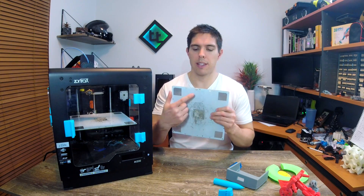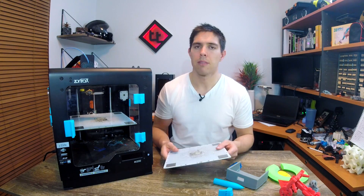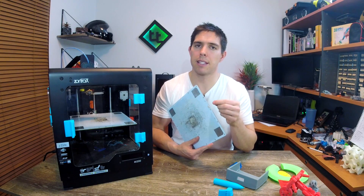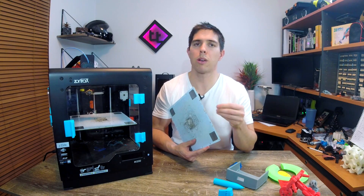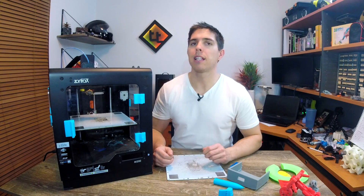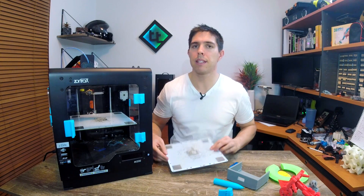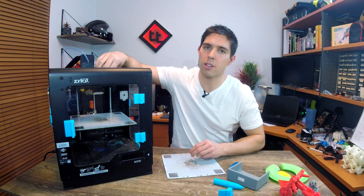One other thing worth mentioning is this tiny exposed connector — it's prone to damage as you're trying to hack off your raft from the perforated bed. We've damaged one and needed to replace it. This plug is not made to be connected and disconnected repeatedly — it's not robust, not quick release, and over time it's going to wear out. This printer needs a lot more maintenance than you'd expect at this price point. My old Solidoodle 2, which came out at a quarter of the price, never had any issues with anything vibrating loose, but this one has had several. You constantly need to open up the extruder and change the nozzle — it's a very time-consuming printer to maintain.